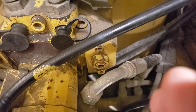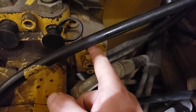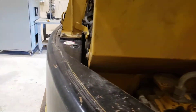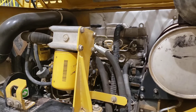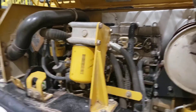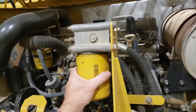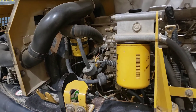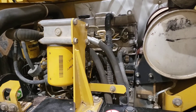We'll be listening to the engine throughout — is it falling on its face, is RPM dropping back? If the horsepower control on the pump is properly adjusted to match the engine's torque curve, the engine RPM should stay pretty consistent throughout the full range of testing. We could have a sick engine — half-plugged fuel filters, air filters, bad injectors, or winter-grade fuel — all of which affect the engine's ability to deliver full power to the pumps. So we want to observe RPM during this test.